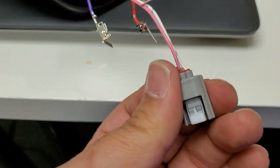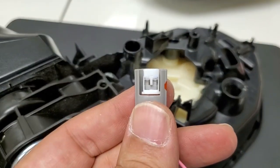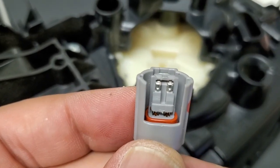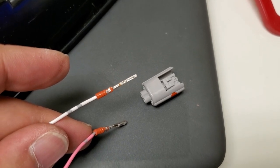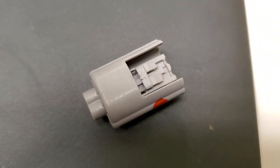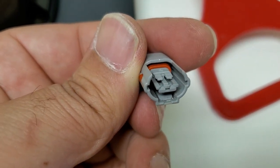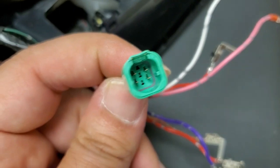The gray one also won't pass through the black channel, but it's easy — I can remove the wires from that socket. When you push this U-shape plastic tab, this white piece will come out. Completely remove the white piece. Lift these U-shape plastic tabs and the wires will come out. For the gray socket, lift these gray pieces — there's a hook on top — lift it up and pull the wire out.